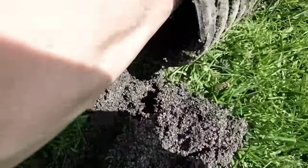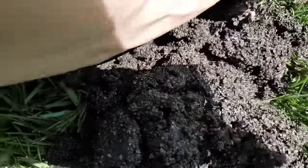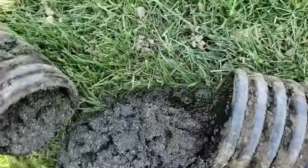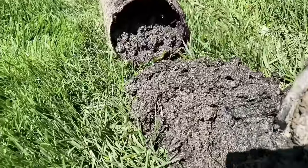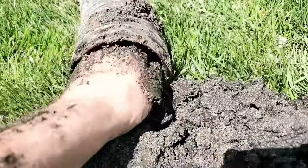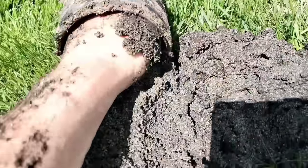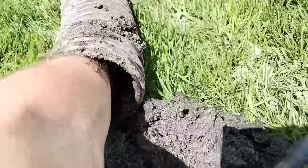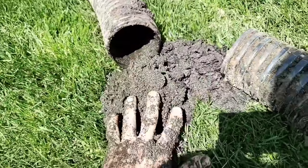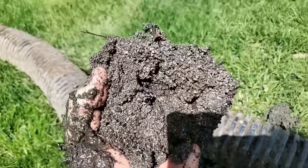Take a look at what an older shingled roof will do as it's aging and breaking down — it's losing a lot of shingle gravel. There's a reason why we have to replace those roofs after a while: the shingles break down, deteriorate, and the roof needs to be replaced. This did not have an inline catch basin, nor was it built with proper slope. It didn't have a pop-up that you could open up and clean out, and it didn't have a Y cleanout that you could push a garden hose through and flush the pipe clean. These are all the things we see done wrong during an underground buried downspout system installation, and unfortunately the corrugated pipe gets a bad rap because of its flexible characteristics.